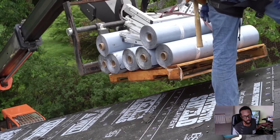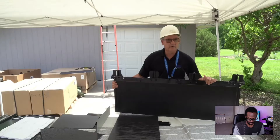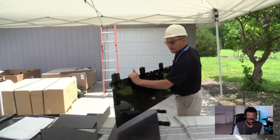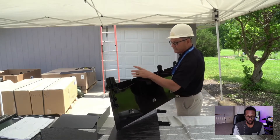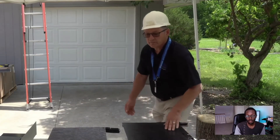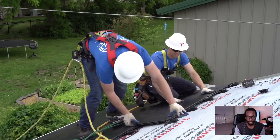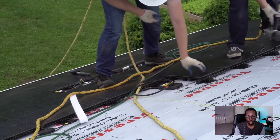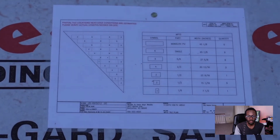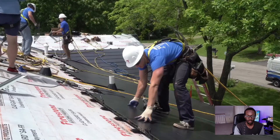What is Tesla roofing or Tesla solar roof? It's not the conventional solar panels that we always see that are unsightly on your roof — it is actually a roof system itself. This particular panel here is a power generating tile. It has wiring integrated into the back, and it has feet that fasten onto the roofing itself. The tile is designed to look like a slate roof, and we also have non-generating tiles. We're starting to lay the photovoltaic tiles on this slope of the roof — sometimes we call them the active tiles as opposed to just the tempered glass tiles.